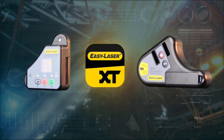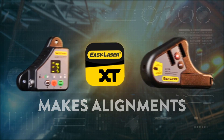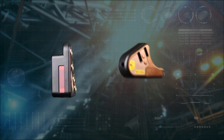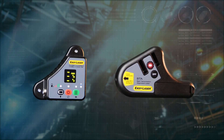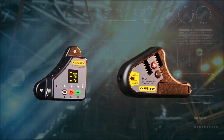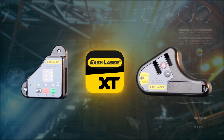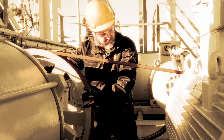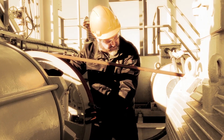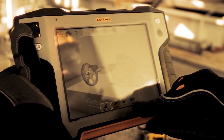Using the app, you also get shimming values. This makes the alignment of the adjustable machine very simple. All in all, the XT190 by EasyLaser is an easy-to-use and reliable digital belt alignment tool. Operated through the same app as all other XT units, the XT190 provides accurate and efficient results in real-time, with multiple readout options documented with a graphical report.